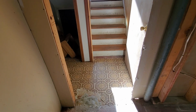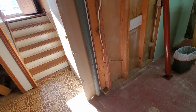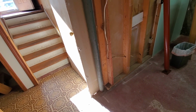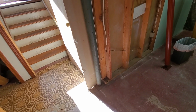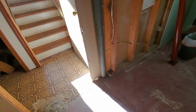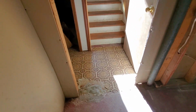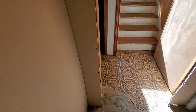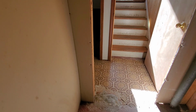This is what my plan is. Another thing before I get to that: you really should have a footing under here. According to the internet, in most cases your footing should be about 2 foot by 2 foot by 1 foot thick of concrete below the concrete pad. People say that depending on how heavy your house is, you might get away with putting it on the concrete pad, but it might crack. To do it properly, it really should be on a footing underneath the concrete pad. My hope is that this footing is actually bigger than where the column was, and I could move it over and put that column behind this little piece here, so it'll be out of the doorway. I can build a door frame there that would be in line with the other one.